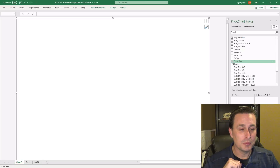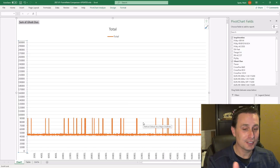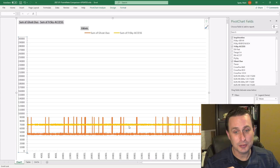Let's get into the big boys — the modules. This is Ghost in a Duo setup. You can see frames are down at around four and a half milliseconds. However, you do get some jumps up to about nine milliseconds. This is only six seconds of flight, not that far away. A lot of times things jump up for telemetry packets, but not everybody has to do it — FRSky with their ACCESS still has telemetry and it's not jumping all over the place.